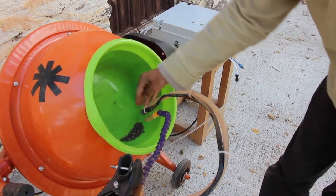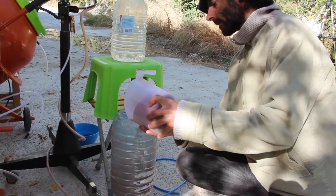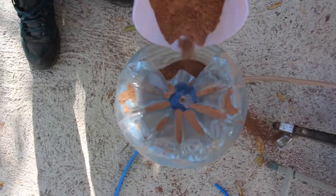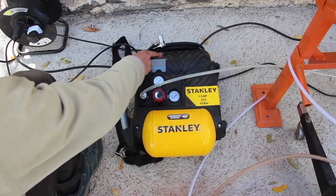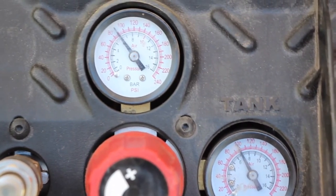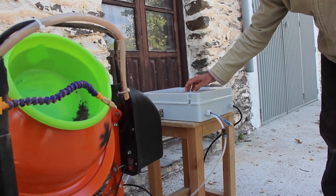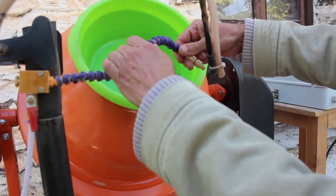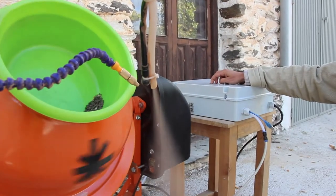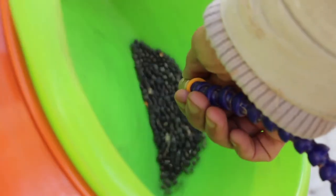Add the seeds and place the pulverizers directly to the seeds. Fill the bottle with the material that you want to use — in this case we use clay. Connect everything, switch on the compressor and be sure that you have at least two bars of pressure. Switch on the cement mixer. First test the pulverizers outside to see that they are working well. If it drops water, change the elevation of the pulverizer until it stops. Place the pulverizer in the final position and adjust the final direction.